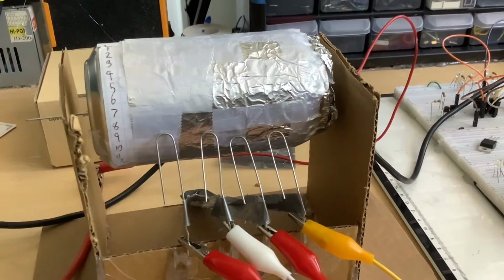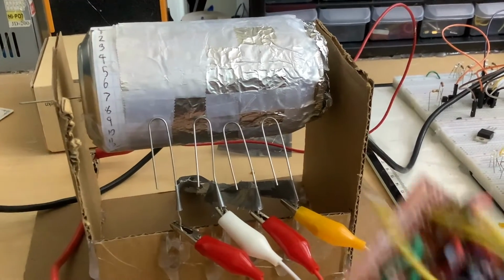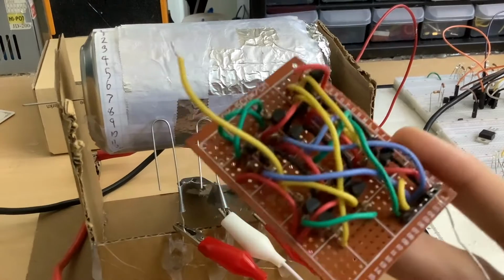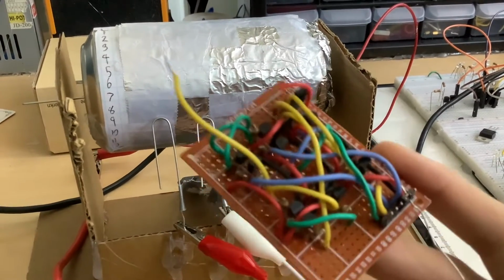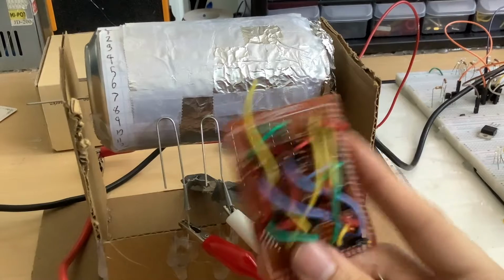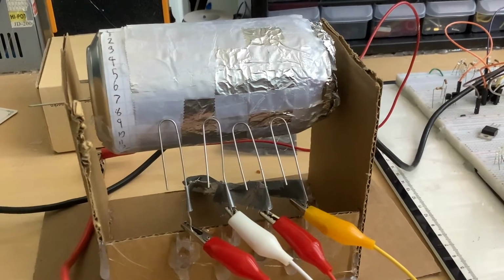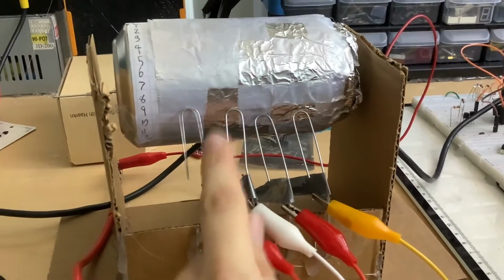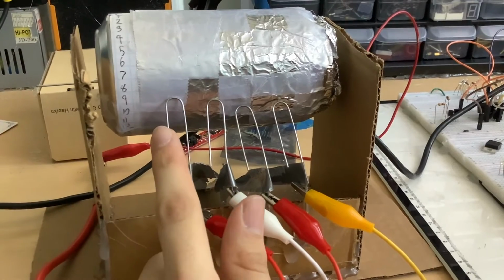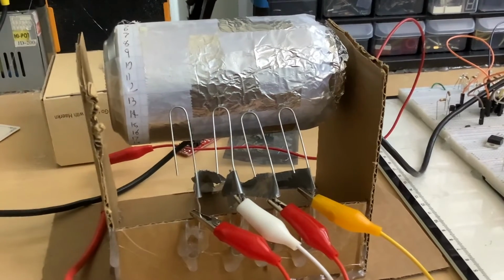Of course, this is all necessary because I've been having a lot of trouble making a flip-flop with BJT transistors. Here's one of my attempts right here. This mess right here, it does not work. I don't know why it does not work, but I suspect it has to do with the fact that BJT transistors consume current, so that makes the architecture harder than if I would just use MOSFETs. This is a 1-bit D flip-flop, and it doesn't work. I need 4 bits, so that's 4 of these. If I made them out of MOSFETs, that would be pretty expensive. I think that just making a bunch of these might be a better option, even though this does need a motor on it to actually spin it, so that might be a bit expensive to make, but I know this does work though, which is a point in its favor.